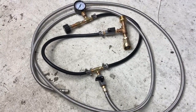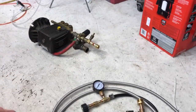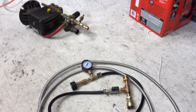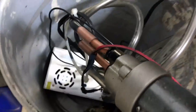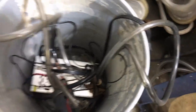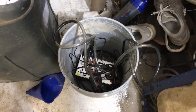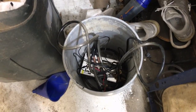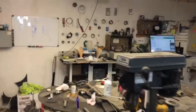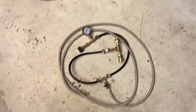Anybody could throw this together. I just want to show you how you can do this if you come across that problem where you have any type of pump — and I'm talking even small pumps, even gear-rotor pumps like this. You'll often have trouble finding one that can provide the pressure and flow rate you need. And I know what you're thinking: just modulate the power output. Well, that doesn't work so well at high pressure. When you try to run a small motor at high pressure with low output, you burn the motor up. The RPMs have to be slow, and then to get the torque you need you have to crank the amps — it's just a nightmare.